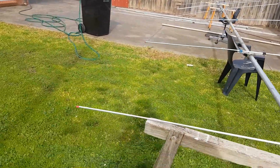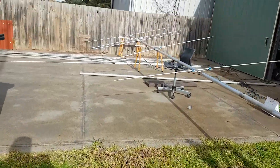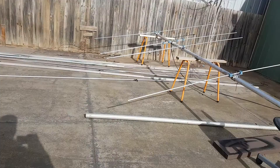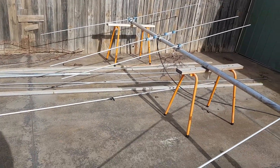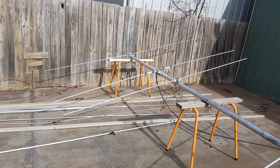The first three elements from the front here — this is element number 1, 2 and 3 — they're the correct ones. And then up here are some of the other ones, the remnants from the previous antenna that I had on, the 5 elements. So they're not resonant, they're not the correct length, they're actually out a bit.